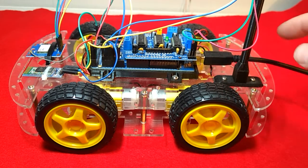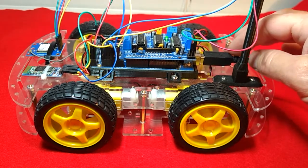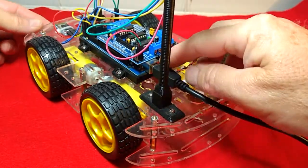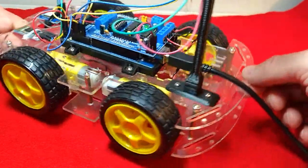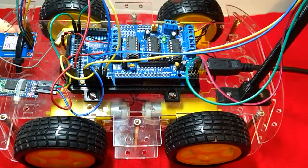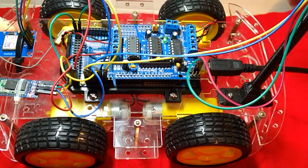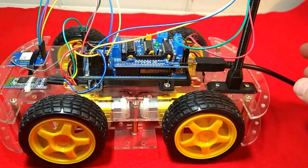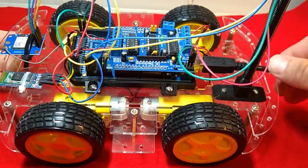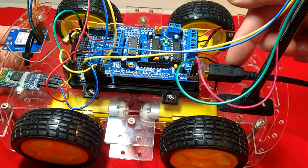As you can see, I've temporarily got power being supplied to it by the computer cable right here, and it's on a USB cable on the back of the Arduino Mega, and that is actually supplying power to the motor control board. Although I would suggest do not try to run the motor control board with just power going to the computer — you could damage your computer, you could damage the Arduino, you could damage the motor control board, so don't attempt to run the motors with just this power going to it.